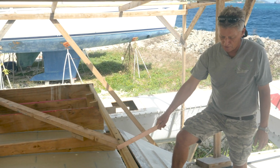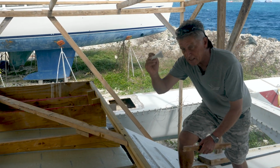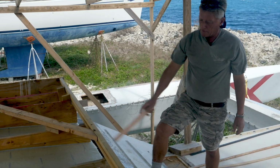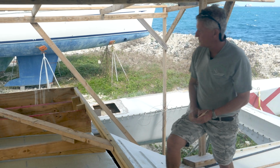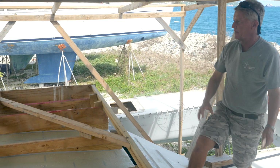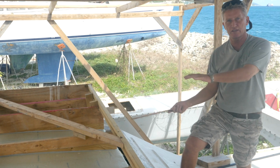And this structure that's gone on top, which I'm calling our cradle, the next job is to attach this cradle to the roof with these little, what we call tabs, and they'll just be going around on the outside, places like that. About 50 of them all around the place. And then that will actually lock this cradle to the roof. And then this Sunday, what we'll be doing is manhandling the whole roof off, leaving the plastic behind. And then it will go sideways and out off from the boat. And then we'll flip it upside down to enable us to get these laminations on the underside.